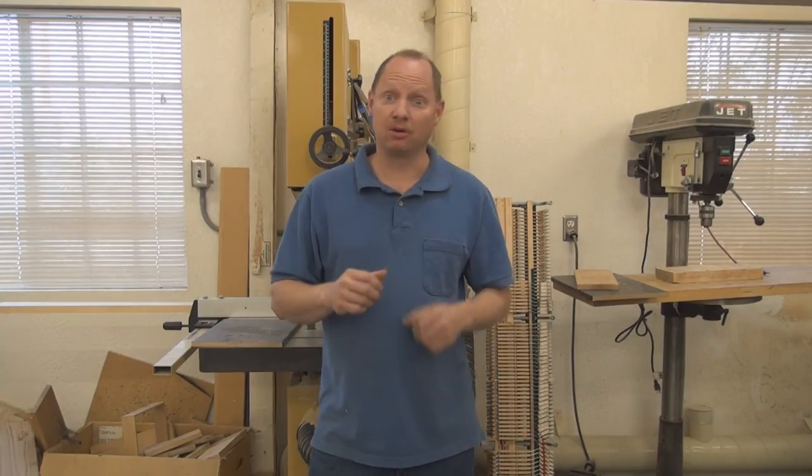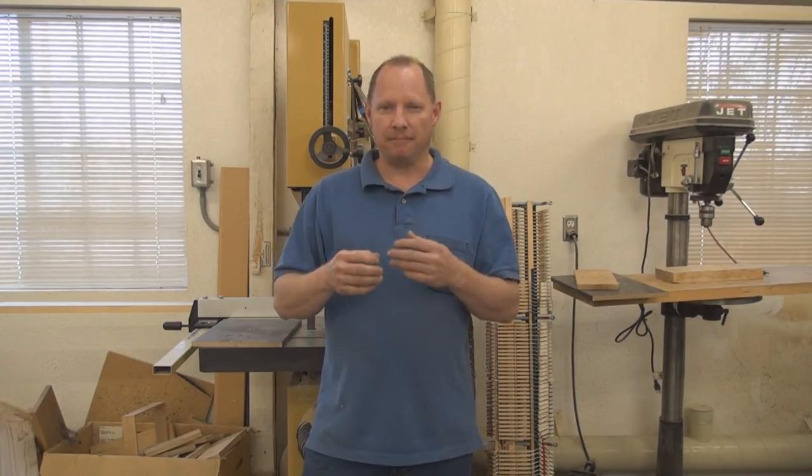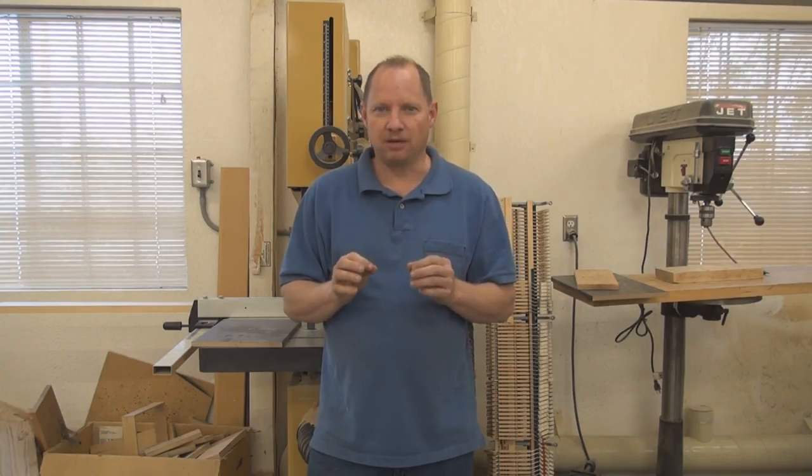You know, sometimes when we are rebuilding pianos, we come across soundboards that have cracks in them. That's a pretty common thing, and there's a few different methods of dealing with it, usually involving some kind of epoxy repair if it's a really minor thing, or if it's a larger crack, we're going to have to gouge it out and put a shim in there.